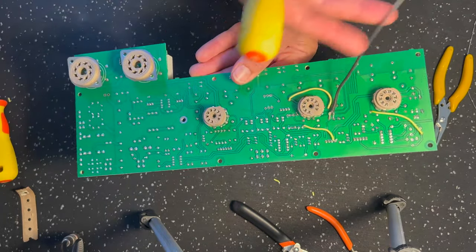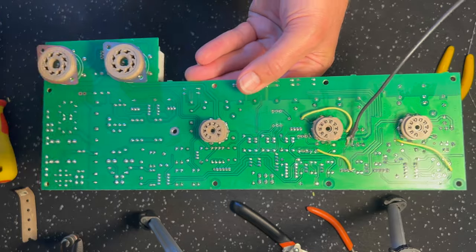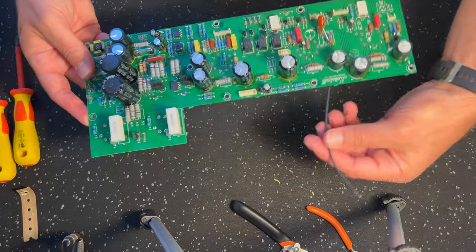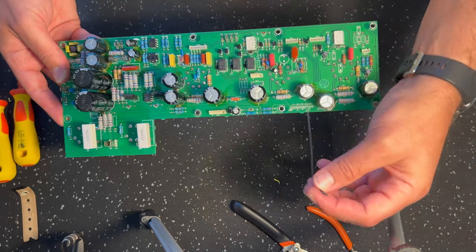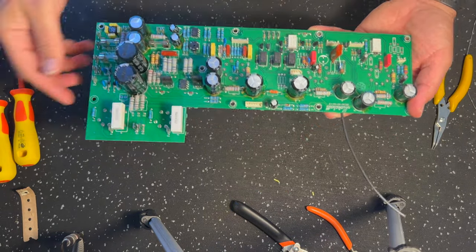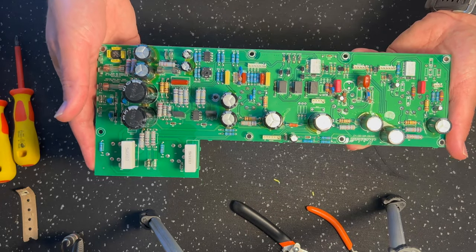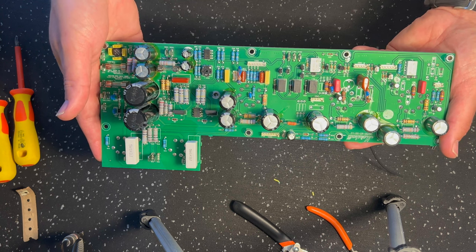This piece of coax here, which I've got tapped off this arrangement right here, again, you can have a look at the Jose clipping video for the details of that. But I've got it set that way because I'm going to run my three-way mini toggle clipping switch for the diodes. We're going to have that on the rear of the amp so that the front of the amp continues to look stock. I think this is ready to go into the amp now, guys, and we'll complete the mod, see if we can get it up and running.